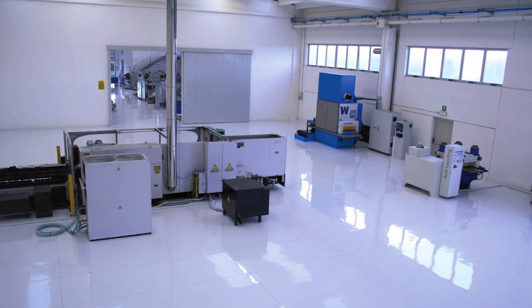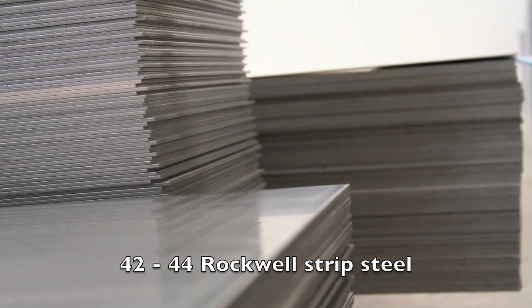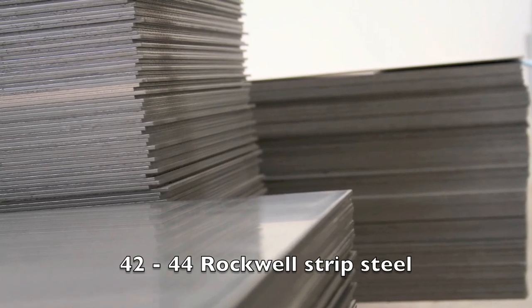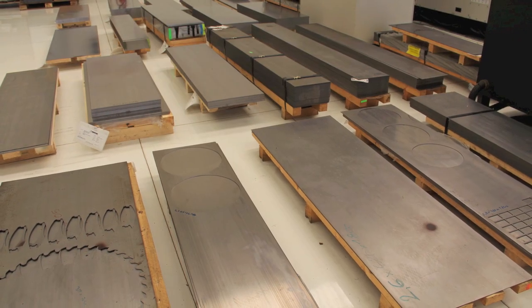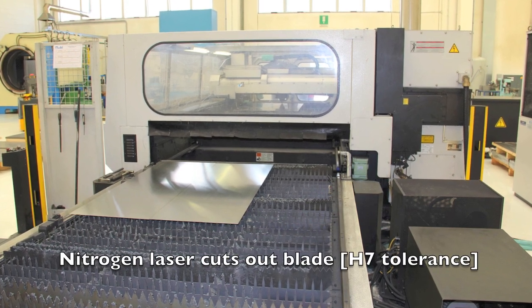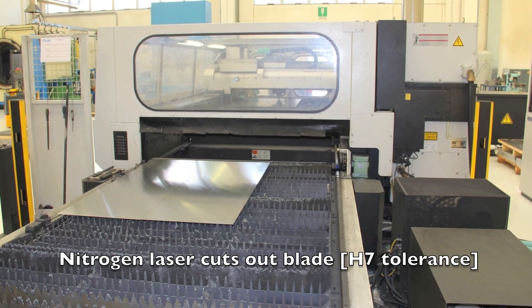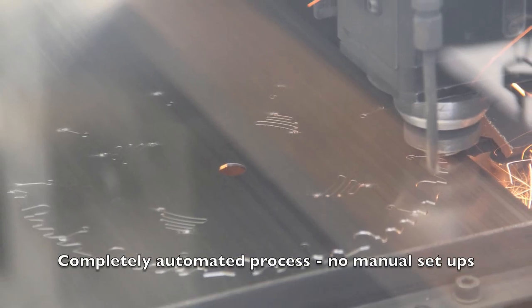The facility that makes the Irwin blades was immaculate and you could literally eat off the floors. They use a really good quality strip steel and they check it for flatness, thickness, and hardness before the sheet stock is placed into a nitrogen laser cutter called a Hypergear machine, where they actually cut the blade blanks out. This is a completely automated process and is done with absolute precision.